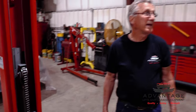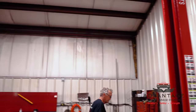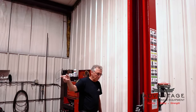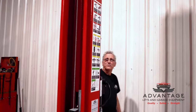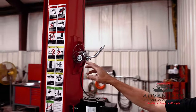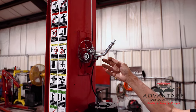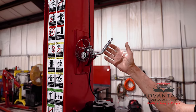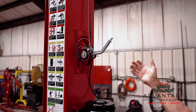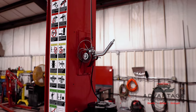Third place to lubricate is all the pulleys that your safety release cable connects to. There's three of them, one back on the idler side and two overhead. And they're controlled by this. And also the pin that the locks pivot on. That's all metal to metal. Use whatever spray lubricant you have. I used WD-40. You can use silicone spray. Just whatever you have, anything helps.